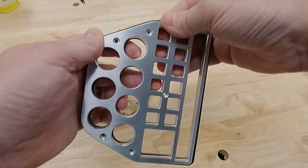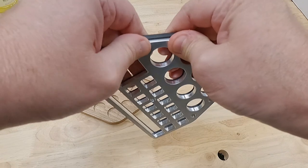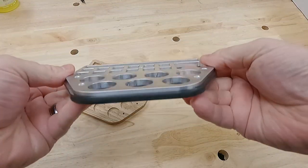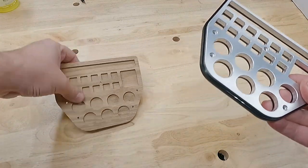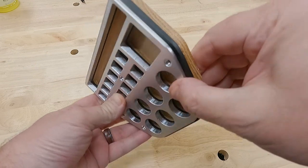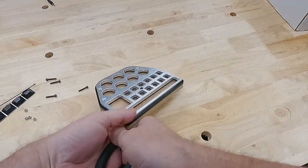In the future I'll get my indicators out and take some final measurements on some of these parts, but this thing fit perfectly — amazingly precise. I can only assume the machine's tolerances and backlash are super minimal. It really just seats on top of that wood, and then we've got several M3 screws that go through with some feet. Getting that hardware together and starting to assemble this is just a matter of putting those lock nuts on the back and tightening down all those M3 screws.